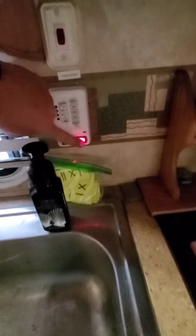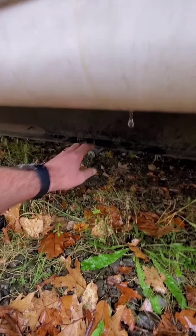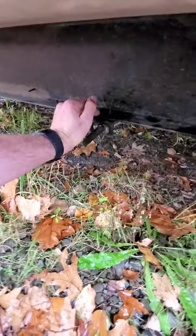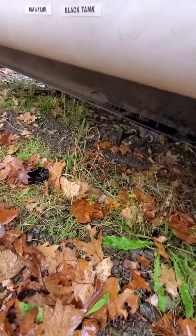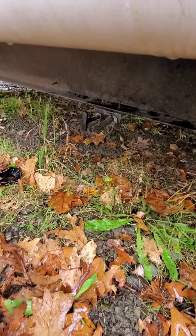And then once you are done, go ahead and turn the pump off. You also want to make sure that you've drained all your water to this point out of your valves and everything. And once you know that's done, you're going to shut all of your valves for the season. You can lubricate them up if you like. And then you're going to pour some antifreeze down each of the drains so the trap valves get antifreeze in them as well.